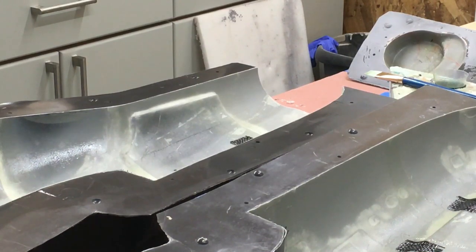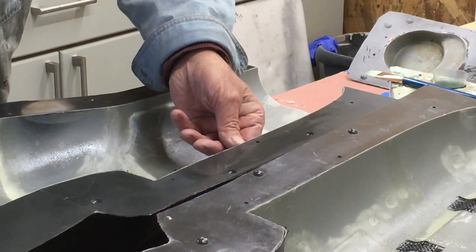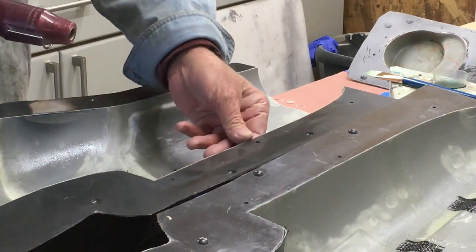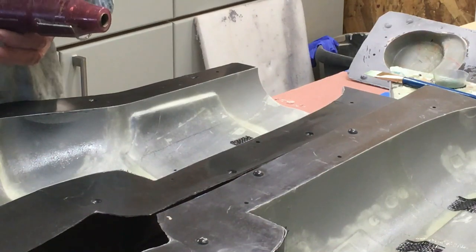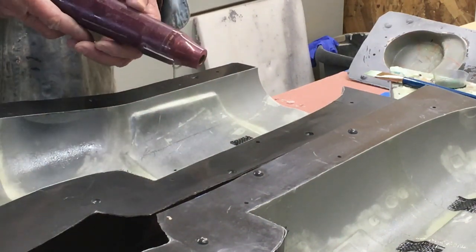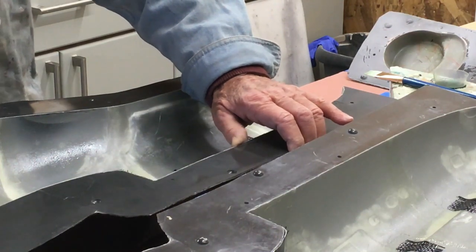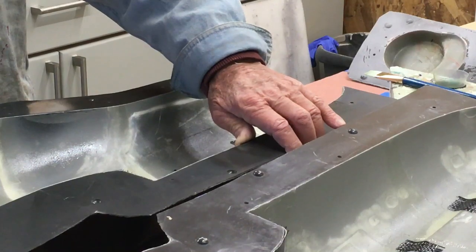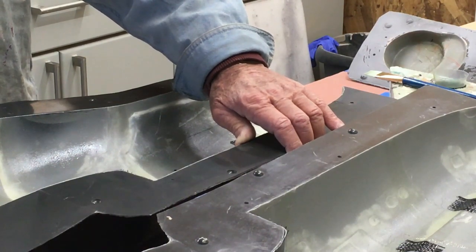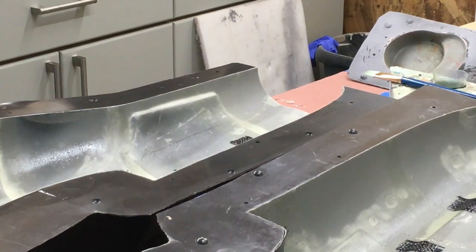Here's a tip: when I was trimming this side I probably got a bit out of kilter and the edge pulled away, leaving about a 30-thousandths-of-an-inch gap. If you don't fix that, resin will get underneath and create an ugly bubble in the seam. To fix it, take a heat gun, get the glass hot, then just push it in and hold it for 20 or 30 seconds — epoxy usually returns to its original form with heat. That's closed up now, so we're good to go. Make sure those seams are touching right up to the mold with no separations whatsoever.